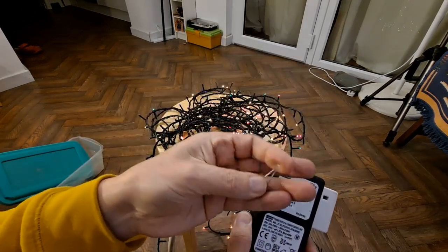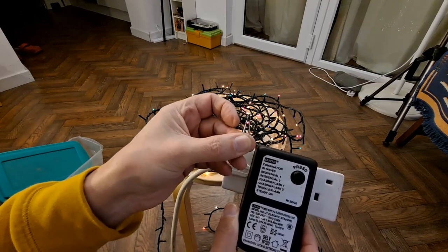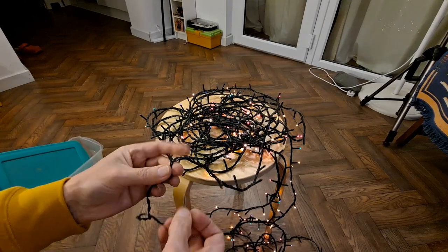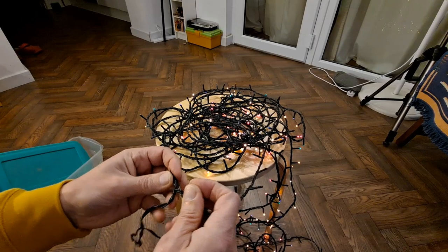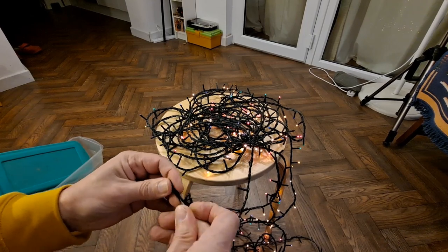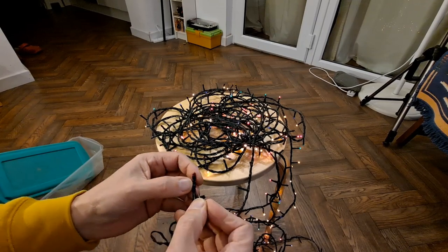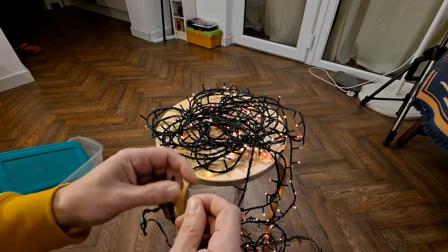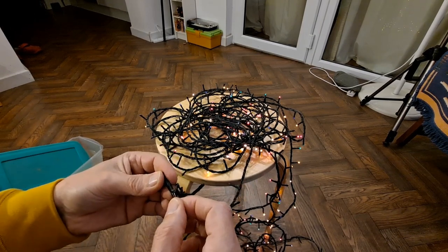And as I say, if I go along with a loop, trying to short out each LED, if there's a dead one, then the other LED should come on. I want to do this in sequence and start right at one end. This is a pretty hopeless way of doing it, but it might work. I'm trying to get either side of the LED, but without stripping the insulation off, you're just guessing. So this could take hours.